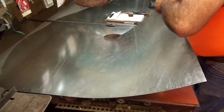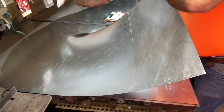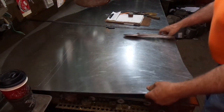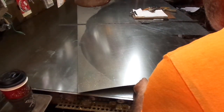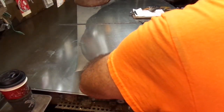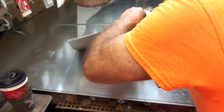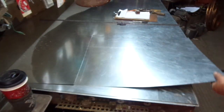I'm going to show you this first piece of duct and explain why it's as complex as it is. First and foremost — this is a two-story house, and you seldom have a single system in a two-story house that operates adequately. It takes a lot of control work, extra things in the ductwork, and a lot of sophistication to make a single system function adequately. Which is why we're eliminating the original system and putting a separate system downstairs coupled with a wood furnace, as well as a complete separate system up in the attic.